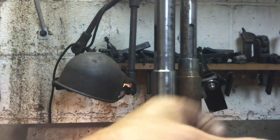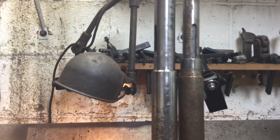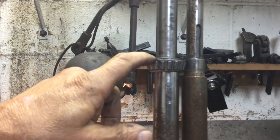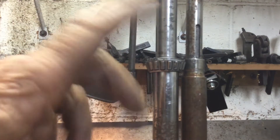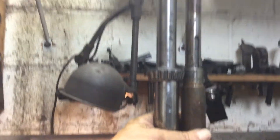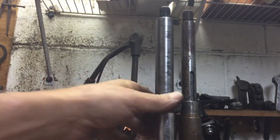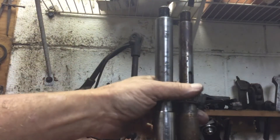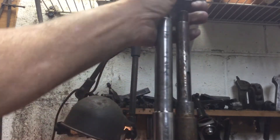This bearing is the outer race that goes on the outside of the axle. When you slide this bearing in place, it goes there. With this bearing and the other bearing — even without the spacer — when you tighten the nut down on the end of this axle, you still have play because of the difference between the shoulder positions on the new axle. The old axles didn't have that problem because the bearings sat all the way down by almost a quarter inch.